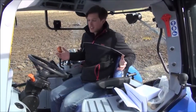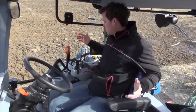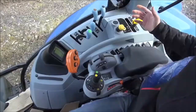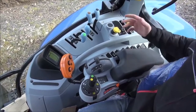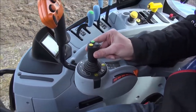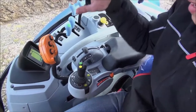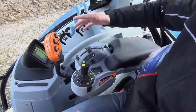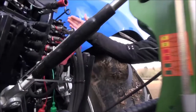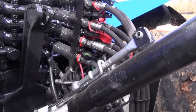It's fair to say the Italians haven't quite mastered the art of interior design — it's all a bit bland and far more spartan than the Massey, but that's no bad thing if you want a simple tractor. Things are pretty run-of-the-mill down the right-hand console. The only little extra is this electric spool for the mid mounts. The big downside is the armrest — unless you've got really short arms you can't shift it forward far enough to be comfortable. New Holland's other big issue was the spool block: they've put it around the right-hand side of the tractor, so you have to go all the way around the plough if you want to fiddle with your pipes.